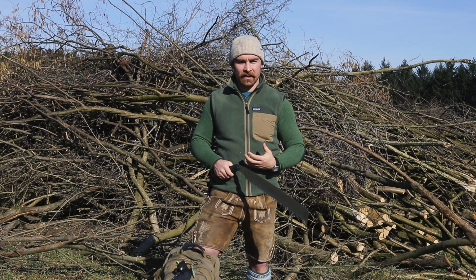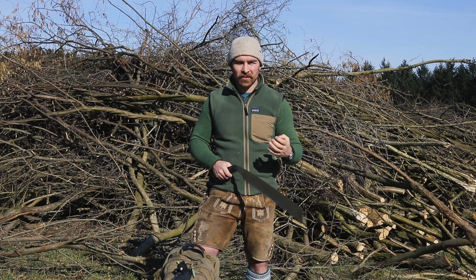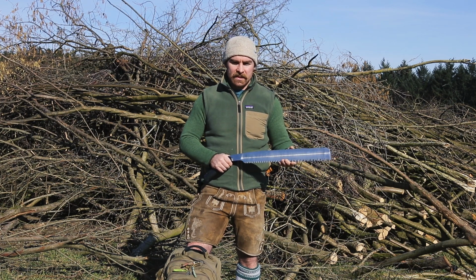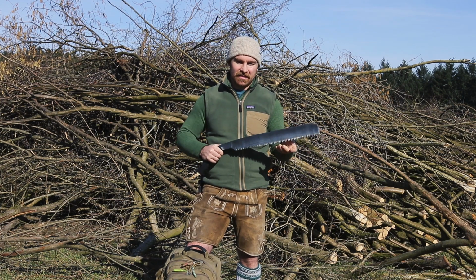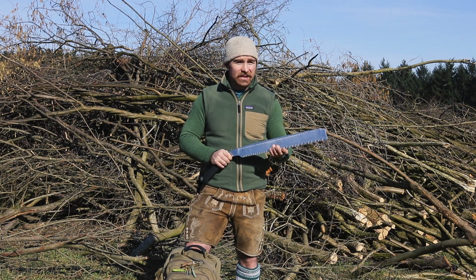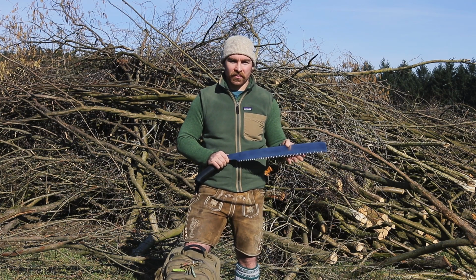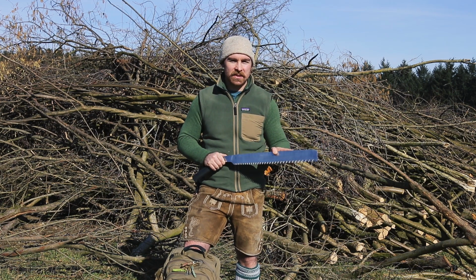Another effect that we're getting by that is that the saw is removing the very sticky sawdust of green wood that is made during the cut, so it's not clogging up. After recently stopping by in Japan at a master biwa maker, which is actually a type of Japanese lute, where I saw one of these temagaris, the original ones with very much the same look apart from having a wooden handle, I was just highly intrigued. And now that I've been able to use this for my work, I couldn't imagine not having this saw anymore, especially for anything that is thicker than, let's say, 20-25 centimeters, where I'm just saving up so much energy.